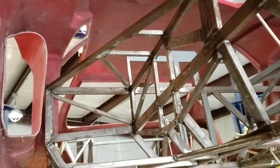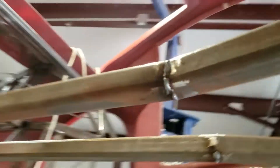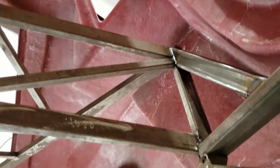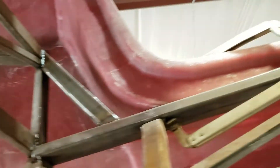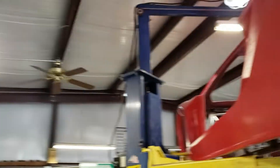The bottom line is the North American Exotics chassis has some good points, but there are some things that don't line up very well. If you look up here, you can see the back firewall is nowhere close to where the roof is, so we're going to have to fabricate a piece to tie into the roof. Got to put supports and basically a roll bar in the roof before I can go too much farther. But all in all, it's fixable.